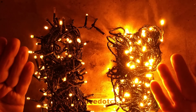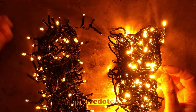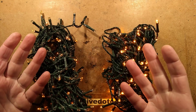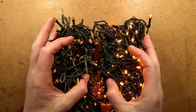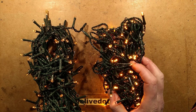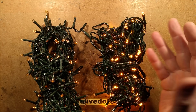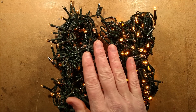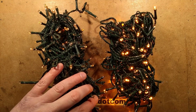It's really very visible. The camera does flatter all lights, but you can see that one is super bright and the other is super dim. To check the difference I used a light meter app on the phone as a rough guide. Holding it at the same height from both sets alternately, the new set came in at 67 lux and the used set came in at just 7 lux. So the used set has dropped by almost 90% from when these were new.